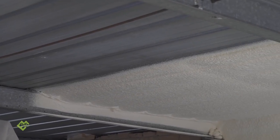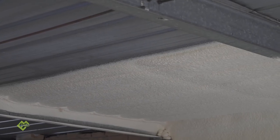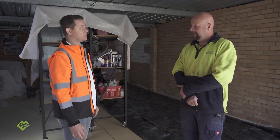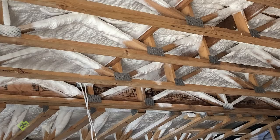Just a tiny little gap with normal batts means that condensation is absolutely going to still form underneath — that will still be a problem. It's just that it's normally hidden. It'll take some time for it to build up where you'll actually see evidence of it coming through the plaster. Or you could go for seven years and not even notice it. Builders today, with the way that builds are done, there are a lot of flat roofs and a lot of very low pitched roofs — whereas back in the old days they were 30 degrees.